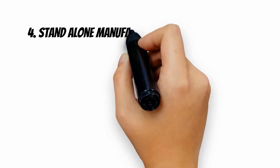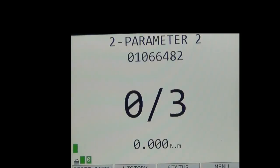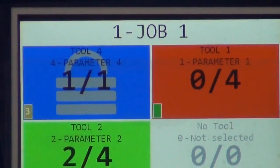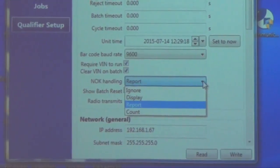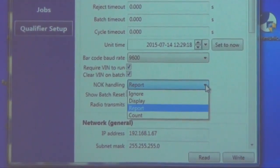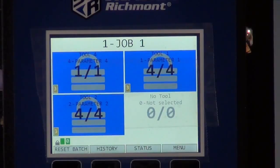Number 4: if you don't have an MES, the Global 400 can function just like an MES. A barcode scanner brings up parameter and job information and you can proceed. The same error proofing exists. If you connect the Global 400 to a stand-alone computer, you can interface with the Global 400 Manager software and still have computer control over the parameter information.